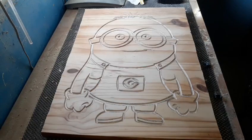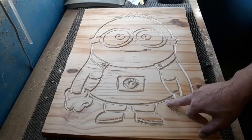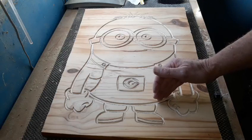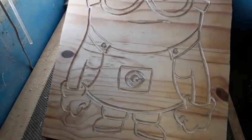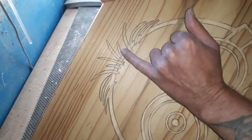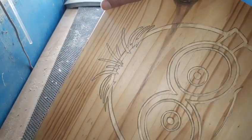Before that, we are going to cut this out on a scroll saw. Personally I like it as it is on this piece of wood, but the person I'm doing it for wants it cutting out. Like I said previously, I made it hard for myself because I've gone and routed out right up to the line. Normally we would have done the inner line with the CNC bit and left the pencil line on the outside, then when we come in with the end milling bits after it's been scroll sawed out, we can just rout off the edge without any issues. So I've made it a little bit harder for myself because obviously I've got no lines to follow. I've left the ear like that because I want some of the ear line pieces to be forward and some at the back — so you get a front and a back, giving it a bit more depth than just cutting it all out on one boring level.